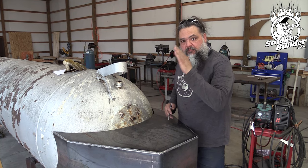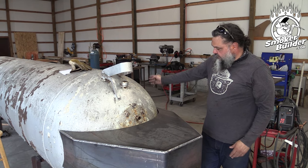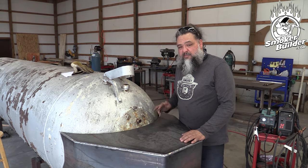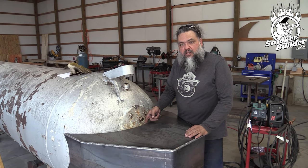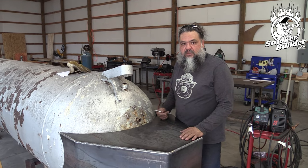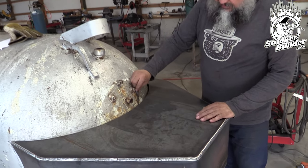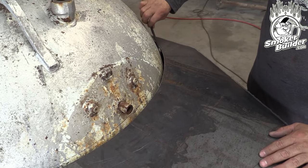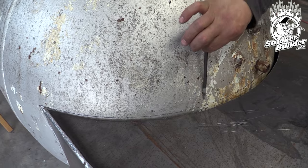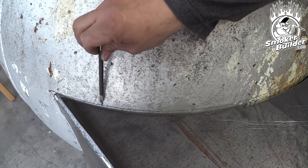You need to lock down the major stuff. Is this square? Yes, it's 90. Is this 90 degrees with the sides? Yes. Does it line up? Yes. When everything's lined up where you want it to be but it just doesn't fit, then we're going to start chasing all of these gaps to make them even. So the first thing you do is start with whatever's touching first. As you can see, there's a big gap. But as we move to the outside, that gap closes — and now there's no more gap, now it's where we want it to be.